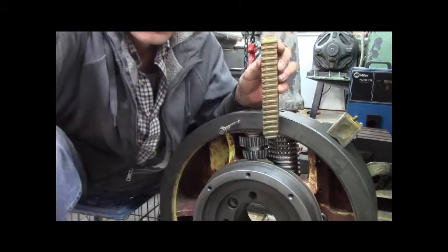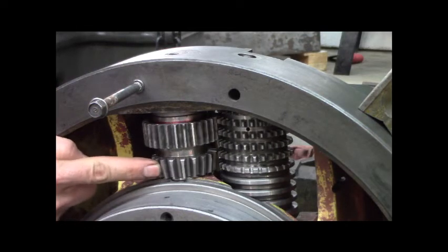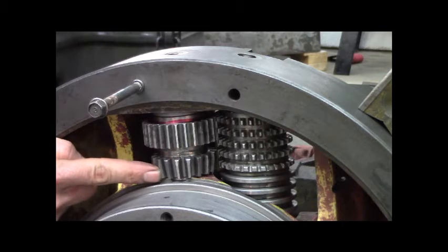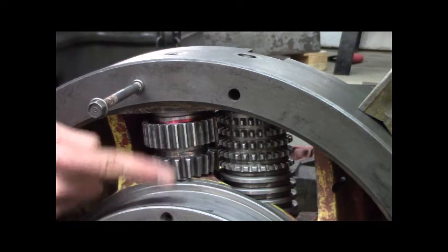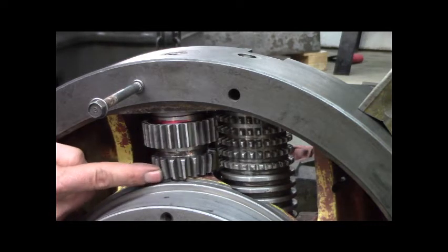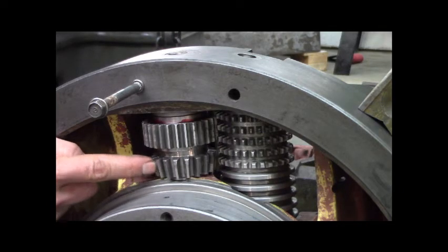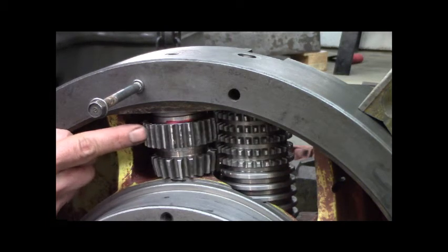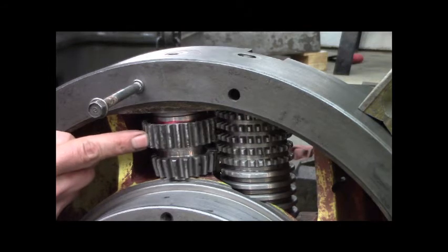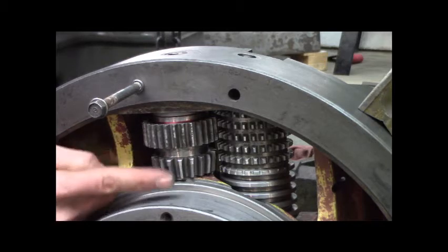Let me zoom in. Normally power comes from a bevel gear - this is a bevel gear, it's got like a 10 degree bevel on it. On this surface is a ring gear that has radial teeth and also bevel teeth. It almost looks like a starter gear for an engine flywheel. But this gear now is just a spur gear - common regular spur gear, straight tooth.